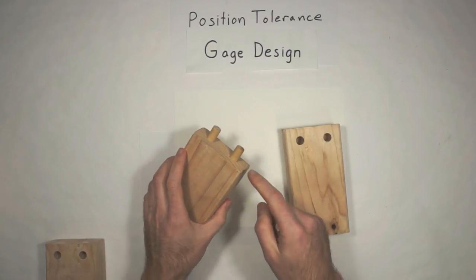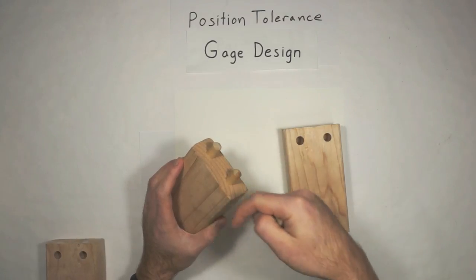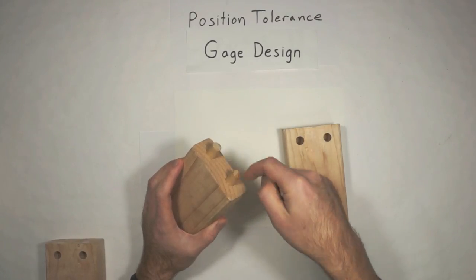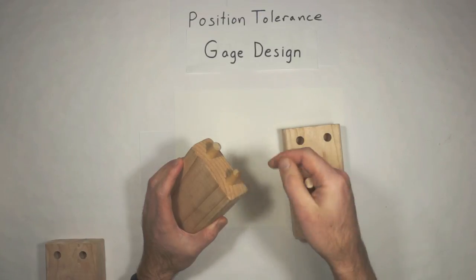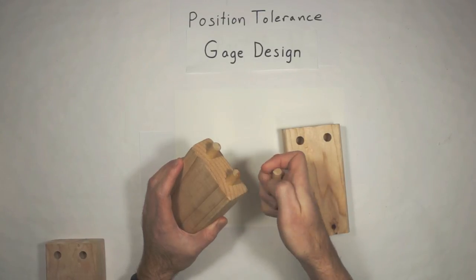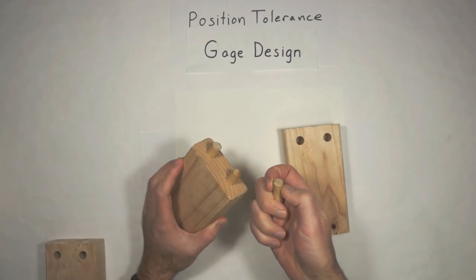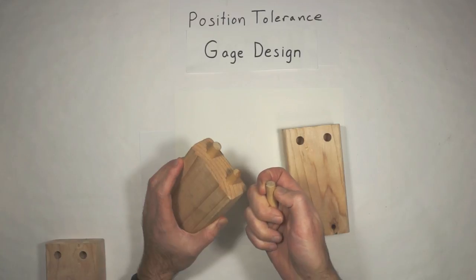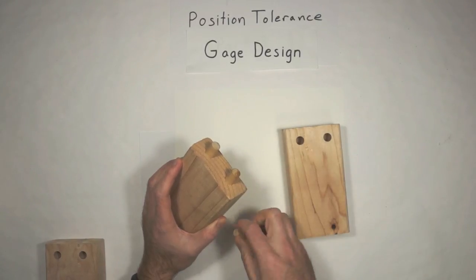And it's the same thing with the pegs, whether we're interpolating and milling around it, in that case, as that end mill, as that tool wore, the peg would get bigger. It would be the same case turning them on a lathe, I guess. As the lathe tool got worn, the thing would grow. So this is going to be bigger at the end of the shift than it is at the beginning.